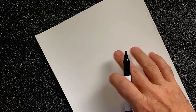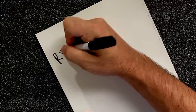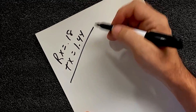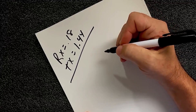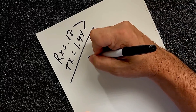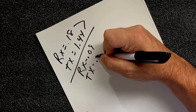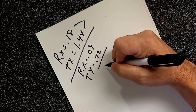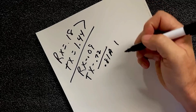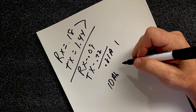I mentioned running this device on a battery, so let's see how long it will actually last. The receive current is roughly 0.18 amps and on transmit we got 1.44 amps. Assuming you're going to use the repeater for 30 minutes out of every hour, we divide both numbers in half: receive gives us 0.09 amps, transmit gives us 0.72 amps. Adding those together gives us 0.81 amps consumed each hour. Rounding up to 1, with a 10-amp-hour battery we would get roughly 10 hours of runtime out of the repeater.